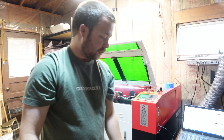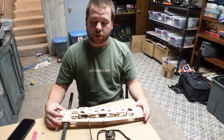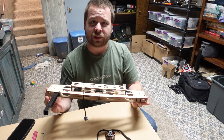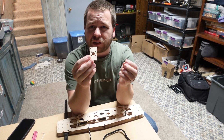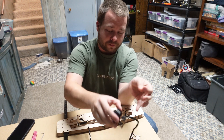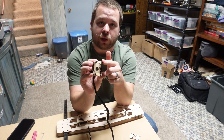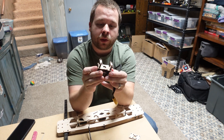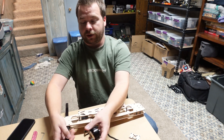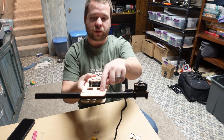I'll show you guys what it kind of looks like as we put things together at the workbench. I got it built up and she went together real smooth, honestly — it went really, really well. I used a lot more standoffs than I thought I was going to use. I did have to tweak the motor mount a little bit. The screws where I had them placed on the first motor mount actually came in contact with the arm and it wouldn't allow it to sit flat. So I made a tweaked version and beefed these up too — they were rather small. I went two millimeters bigger on every side to give it a little more material, tilted the motor screws a little bit, and got rid of two holes since I'm only going to use two per motor. They just slot right into the arm — kind of a friction fit. Once you tighten these bottom bolts, it snugs in really well.